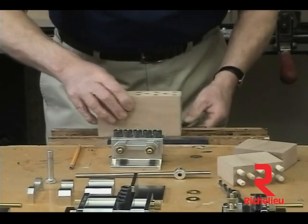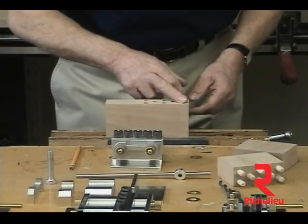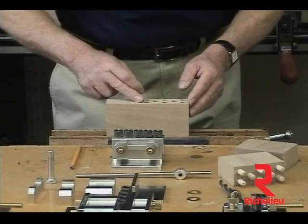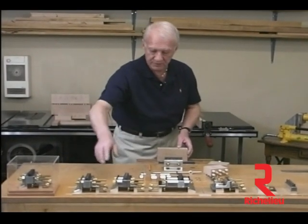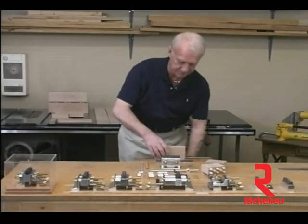With the triple row, these require to be staggered, and the first row is conducted with Dowelmax in its normal configuration. The second row is conducted with Dowelmax with the 3/8 spacer, and the third row is conducted with Dowelmax incorporating the 3/4 inch spacer.